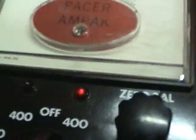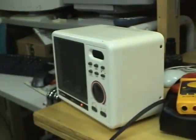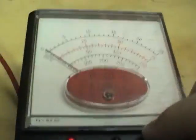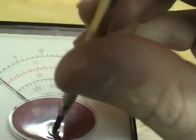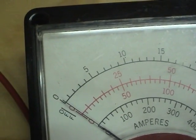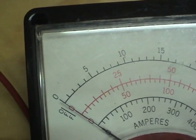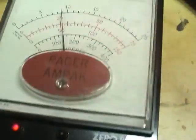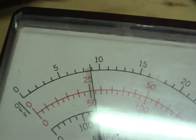Okay, now we've got the light. Got some current flowing with the heater now. The meter is connected. Let's just zero the scale — that's exactly zero. Let's connect this up and see what it does. It's reading about just under nine amps, so it's a bit low.